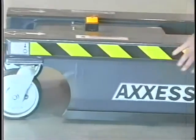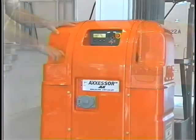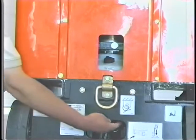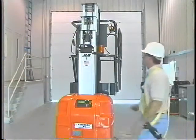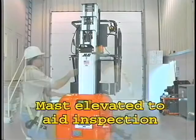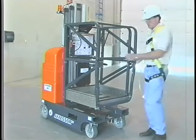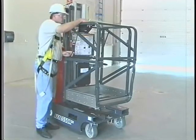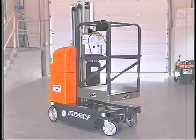The inspection covers the drive wheels and casters, base frame, and pothole protection system; the battery and battery charger installation; the hydraulic motor pump and reservoir unit; control valve; manual release valve; ground controls; the mast installation including the mast chains, mast cover, electrical cables, and sequencing cables; the platform assembly including the control and power cables, guard rails, entrance gate, and platform controls. Be sure to inspect the legibility of all placards and the overall cleanliness of the machine during the walk-around inspection.